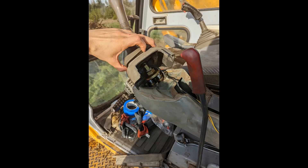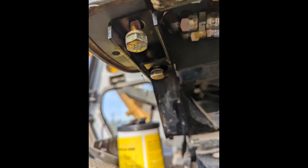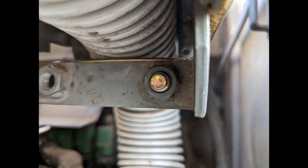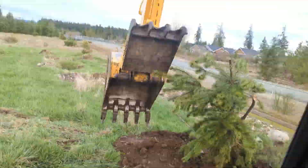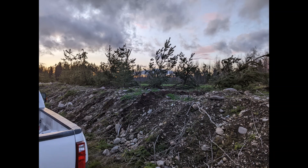You can see here how the housing goes back together — you put those bolts on, then put the plastic sleeve back down, put the screws in, and that holds it all together. To reattach the lever armrest portion to the seat, you put the bolts on the back and front, then bolt back down the big gray box and put the screws in for the lock-unlock cover. Here's me — my son's doing the cinematography, so it's a little rough since he's about three years old. It shows me doing a little work with the excavator putting some more trees up. Got the machine back working, I'm quite happy about that — although now I have a diesel fuel leak, so that will be an upcoming video.